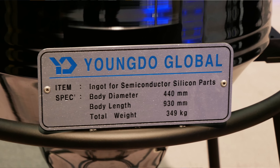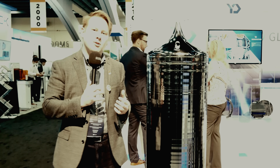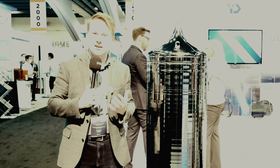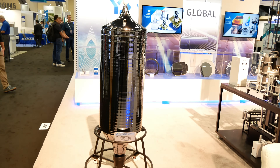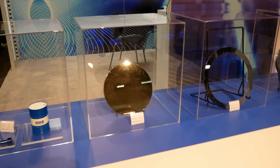And you're thinking, why do we have a 17-inch wafer? This is 440 millimeters. Surely after we go from 300-millimeter 12-inch wafers, we go to 450. Well, the point of this isn't that it's being used for chips. Speaking to some of the representatives here at YD, a 10-year-old company who make the manufacturing tools to create these ingots — or boules, however you want to pronounce it — the whole point of doing this sort of thing is that when you cut it up, you essentially have a carrier for your standard silicon wafer. As the silicon wafer goes through the machines, you need some level of carrier support that's bigger than the wafer itself. For this, you don't need that 99.99999% pure polycrystalline silicon in order to make chips out of it, just because it's a carrier. But you still need something that you know behaves much like the chip you're trying to produce.